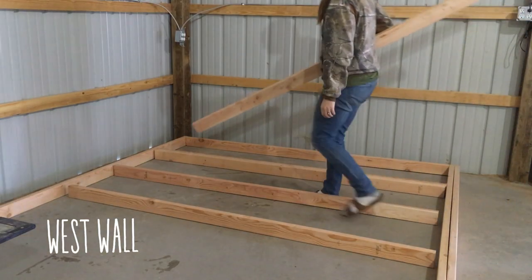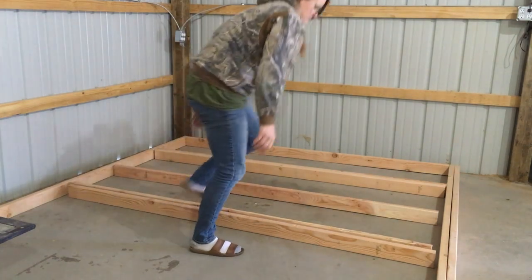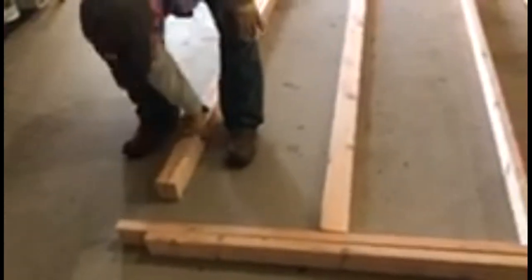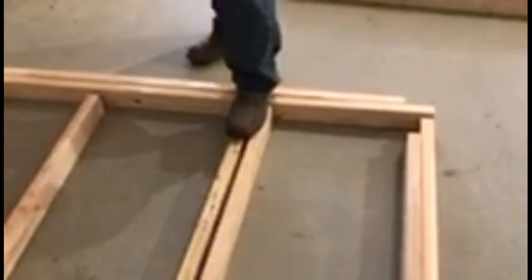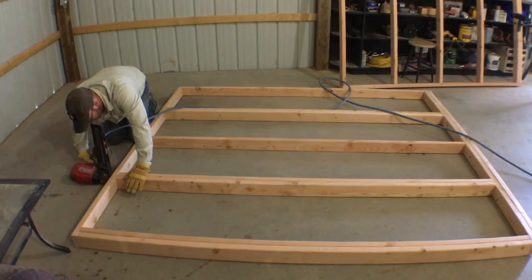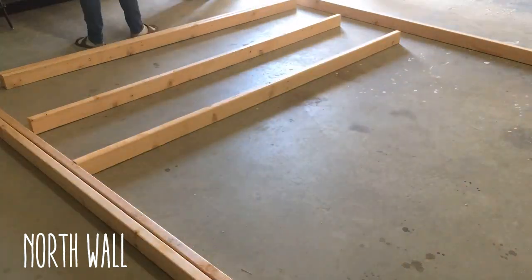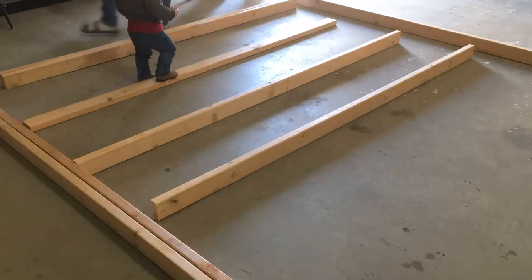This one right here that I'm standing on — this is going to be a double. Why are you doing the double? I'm nailing two boards together to fill the void, because if you just put one back here and put this wall to it, there's a big hole and no space — you need spray foam there. You need two boards to that wall. There are two boards here because we're going to hang our rails inside to hang meat on, so you need it reinforced.